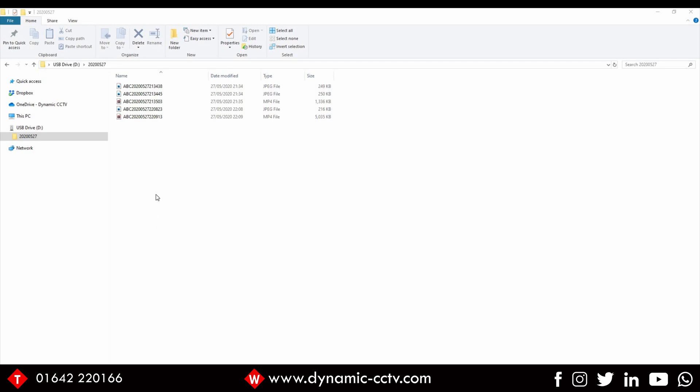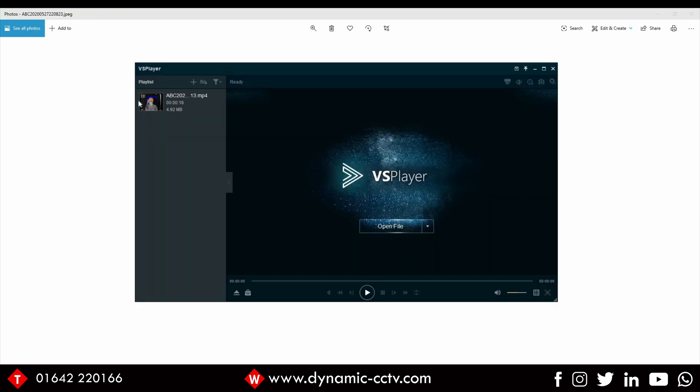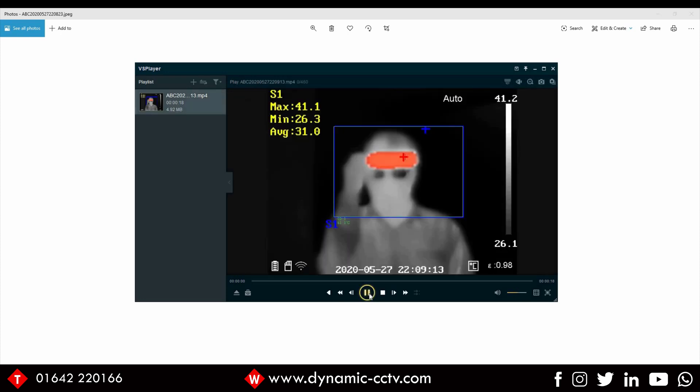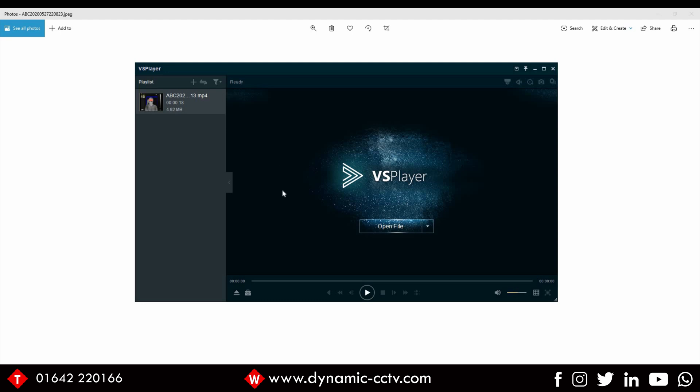I've now connected the handheld to my PC. When you connect it, it appears like a USB drive and you'll see folders with snapshots and video. Snapshots are captured as JPEG and video as MP4 — Hikvision's own bespoke MP4 format which plays through their VS Player. Opening the JPEG captured earlier you can see it's captured the screen of the reader — all the information is there including maximum, minimum, and average temperature, plus the cross indicating the highest point on my colleague's forehead. For the video in VS Player, you can see the alarm condition playing: minimum, maximum, and average temperature visible, with the hot spot fixed on the warm bottle of water at 41.6 to 41.5 degrees, which was causing the handheld to beep into alarm mode.